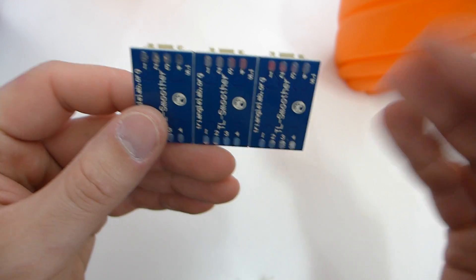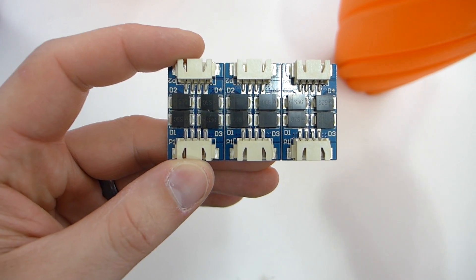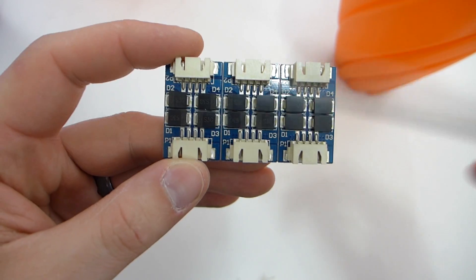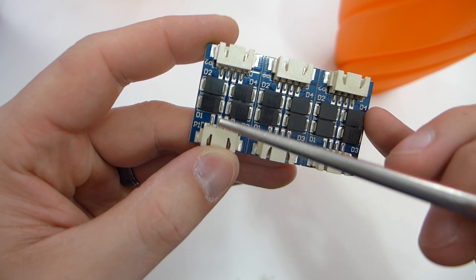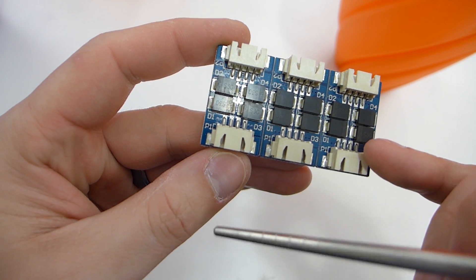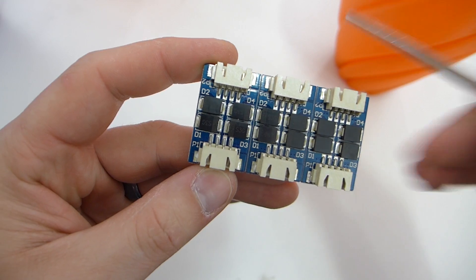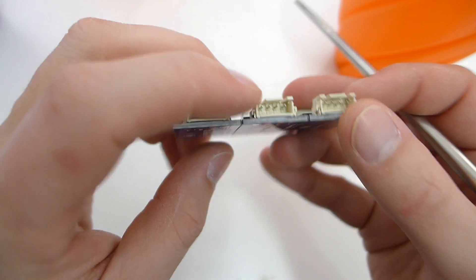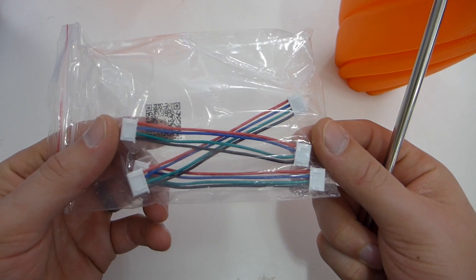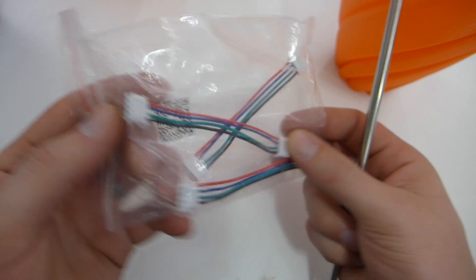Here are the boards — they came four together. I'm using one in the printer currently. They use one, two, three, four diodes. The eight-diode ones use eight diodes, so instead of being four big ones, there are eight smaller ones in there. Very simple connections. As you can see, it says P2 and P1. P1 goes to the actual board — board to P1, through the diodes, then out P2 into the actual motor and the motor drives the belt system. Very simple design and very easy to use. Just literally plug one end in — they come with little jumpers — plug the other end in and you're good to go.